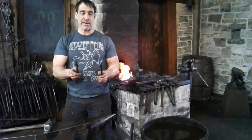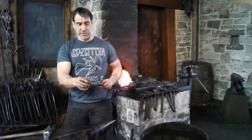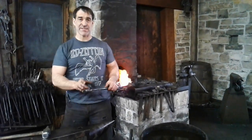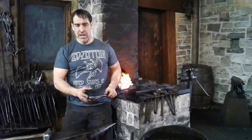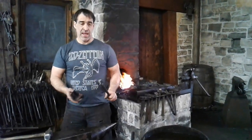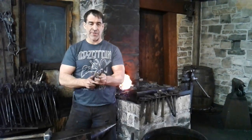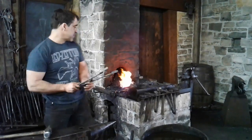At this point, I'm going to make these into a specialty pair of tongs. This particular one will be ring tongs. I've got a couple other blanks there that I'm going to make into blade tongs or box tongs, and also v-bit tongs. So we'll get started — we'll heat these up in the forge first.